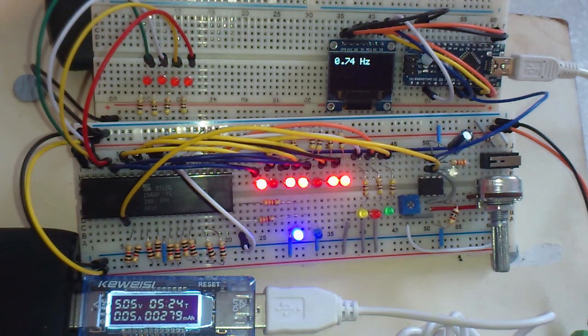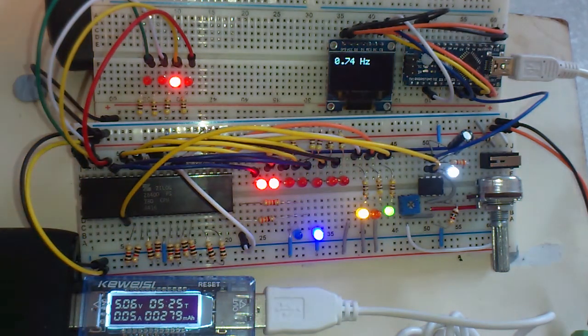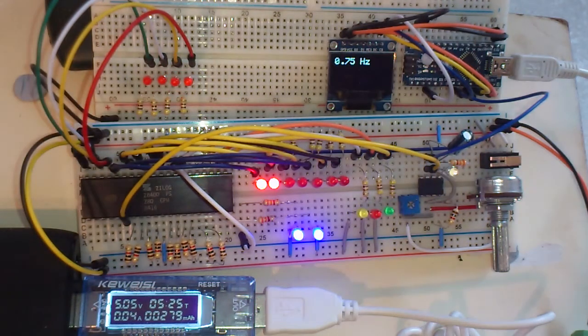Yeah, so that's as slow as I can go, and you don't see much more that we see at the 1 hertz really. It gets a little bit uninteresting as you get slower and slower. You could also set up a stepper circuit, as people have, and you can just step through. If you really want to investigate complicated instructions, a no-op is not particularly interesting.